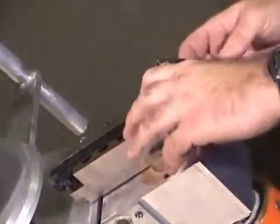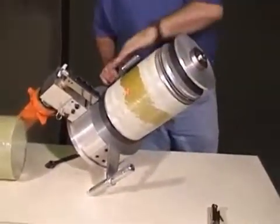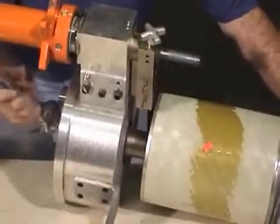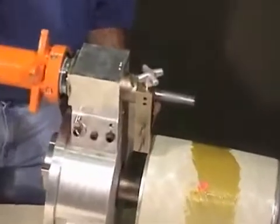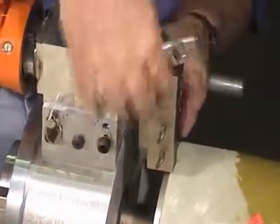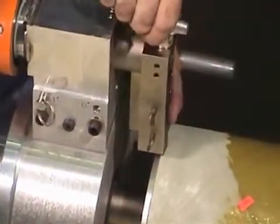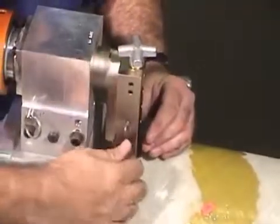Put the factory taper gauge onto the mandrel as a guide to adjust the tool setting to factory dimensions. Tighten the mandrels with a mandrel nut. Advance the cutting head over the factory taper. Loosen the thumb screws and turn the feed knob to move the cutting head down until it makes light contact with the factory taper. Tighten the thumb screws at the bottom of the cutting head insert.